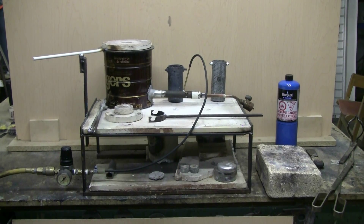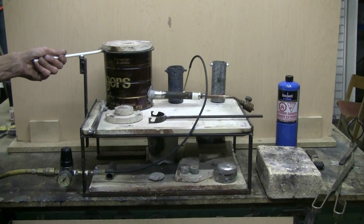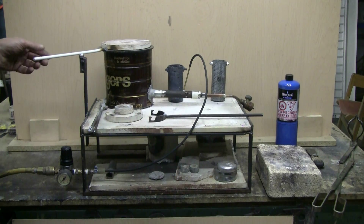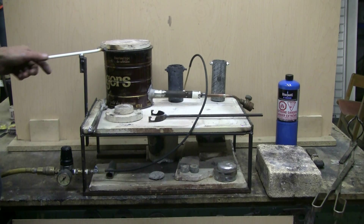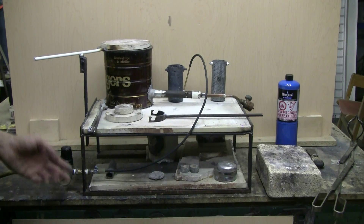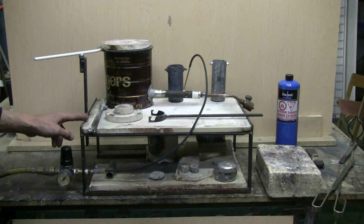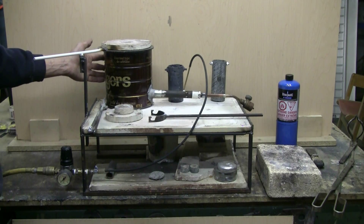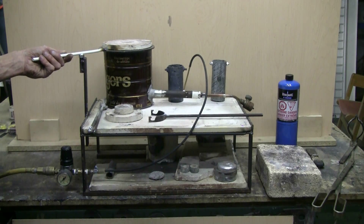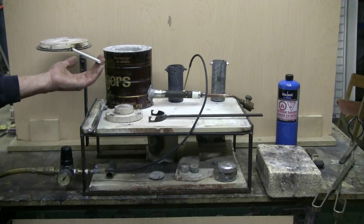This is how I decided to set up my coffee can based mini foundry furnace. Having completed the furnace body, made burners and crucibles, it was time to pull the whole project together on some kind of a stand. I took some scrap steel and welded up a two-level stand so that I got some storage underneath, with the coffee can mini foundry furnace up top. I also made a little lid swivel at the height of the coffee can furnace so I can easily swivel the lid aside when I need to look inside or insert or remove the crucible.